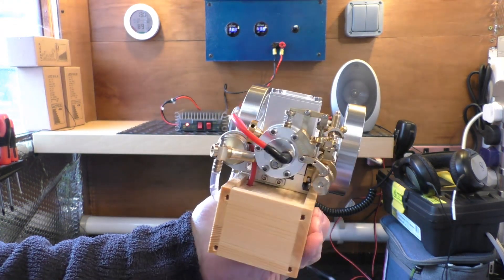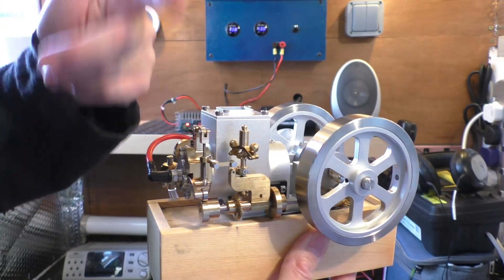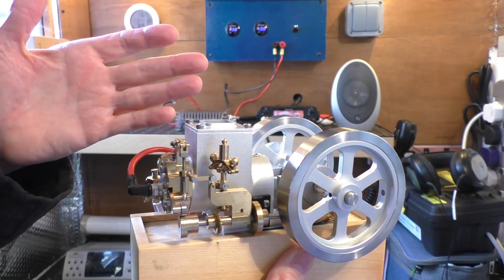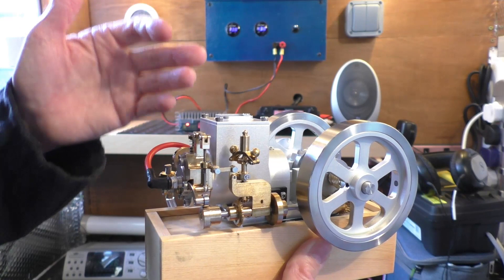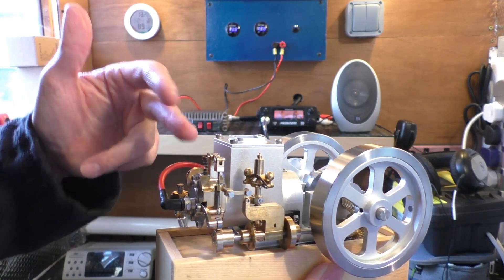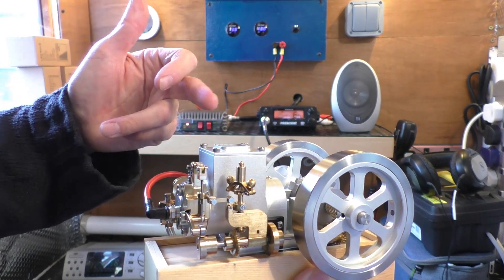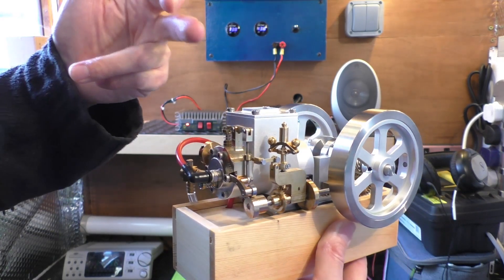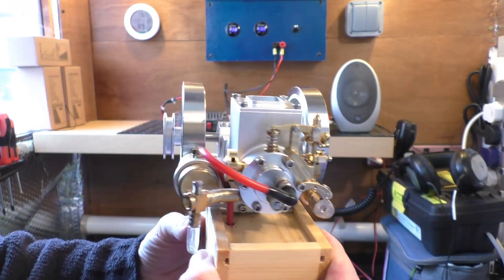I think they're exceptionally cool. When I start this engine in a moment, you're going to hear it run and go put-put-put. Being used to a regular four-stroke engine that fires on every compression stroke, you're going to think the engine is missing — but that's not true. When you hear it fire, that's when the cylinder is firing under compression. The rest of the time it's just freewheeling, not taking in any fuel and not firing. It fires about every fifth or sixth cycle on tick over, and the rest of the time it's freewheeling without any fuel. It's quite fascinating.